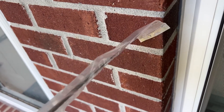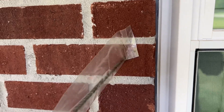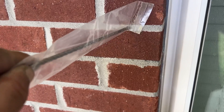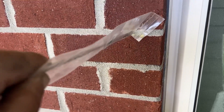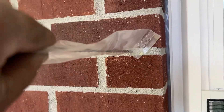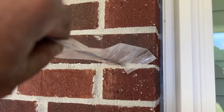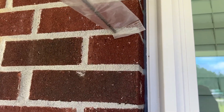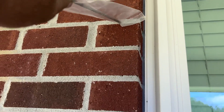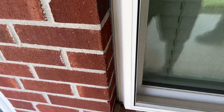You don't really want to go through the brick — brick tends to bust and break. These things are supposed to be every 12 inches. If you'll count the mortar joints — one, two, three, four — go every four mortar joints. On this house that works out to between about 10.5 to 13 inches, and I've never failed an inspection even in Florida where they've got the strictest codes — not in Niceville, Melbourne, Destin, Santa Rosa, Mobile, Panama City, Jacksonville — all over the coast.